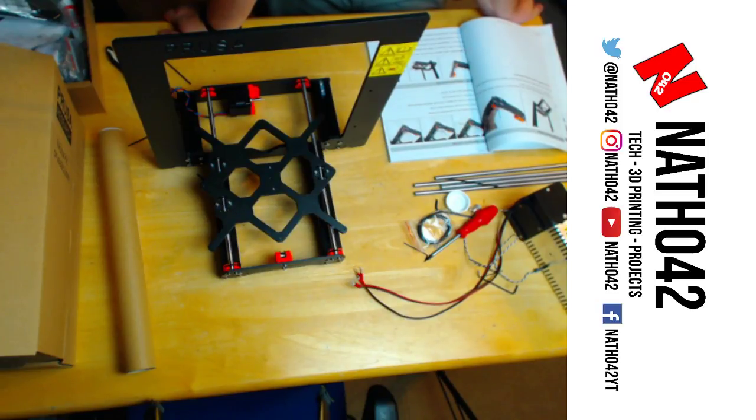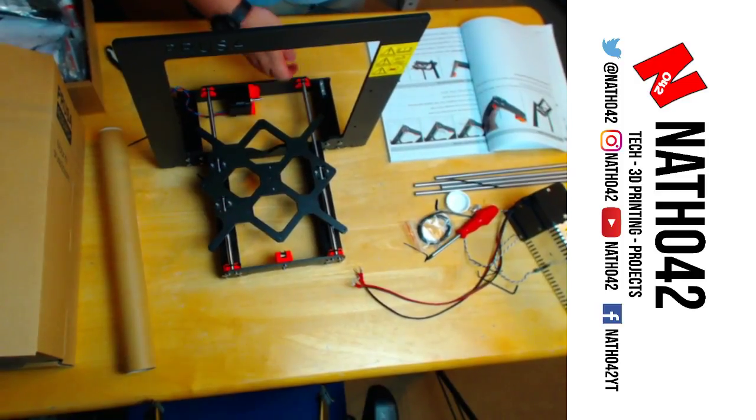Aligning the smooth rods. We didn't do that. Repeat this step in all 4 corners. Proper alignment of the smooth rods is crucial to reduce noise and overall friction. Ensure all M3 10 screws are released so the printed parts are able to move. Well, maybe, I mean, not quite. They're kind of released so that they're able to move.